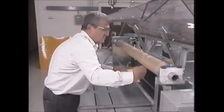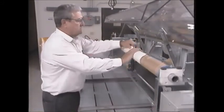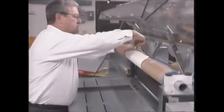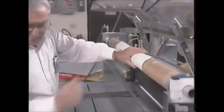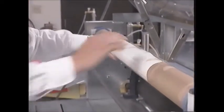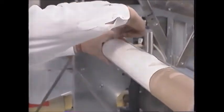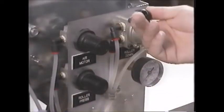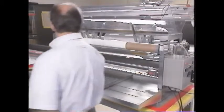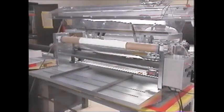Pull the sheeting from the gap and, while keeping it taut, tape the liner to a core on the liner take-up mandrel. Using the control valve, raise the top nip roll. Feed a starter panel into the applicator under the top nip roll.